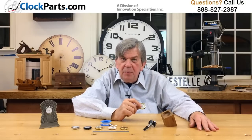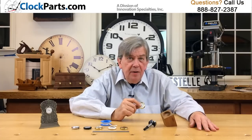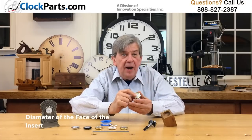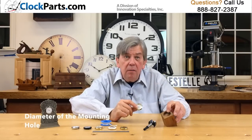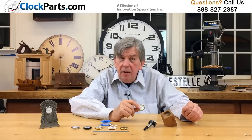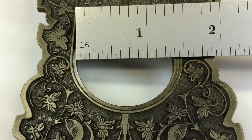If you're doing a replacement, then here is where we really need your attention. There are two important measurements: the diameter of the face of the insert and the diameter of the mounting hole. Usually there's a little flexibility on the size of the face, but very little flexibility on the diameter of the mounting hole.